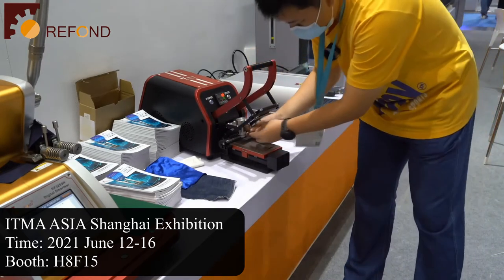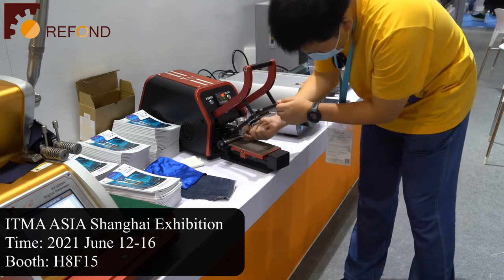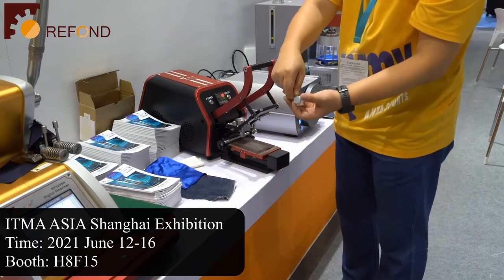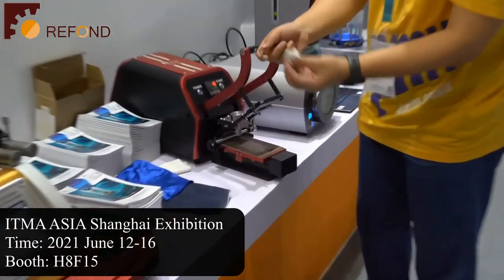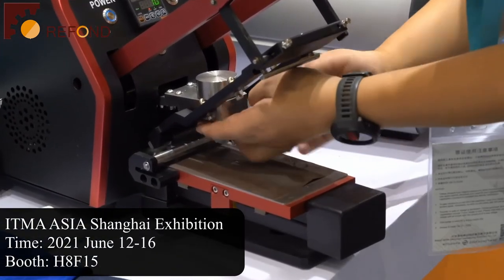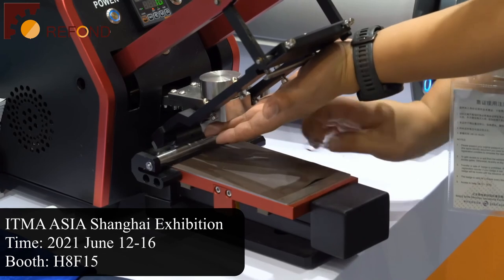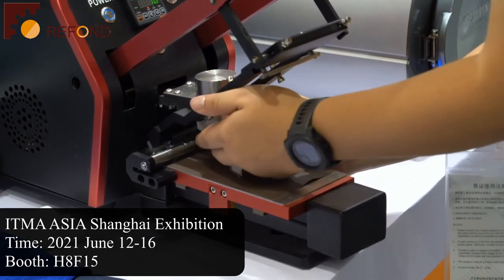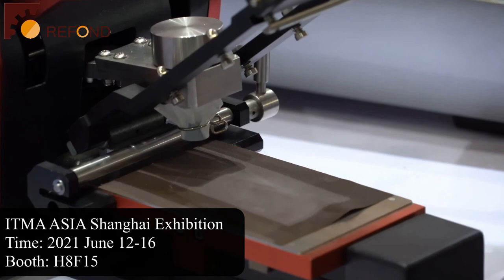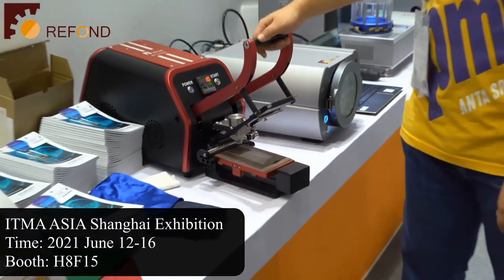For changing the white rubbing cloth, you just lift the handle up and then reach down to the spring. Squeeze it gently and the cloth will come out. Then you just need to put on the new cloth — put it on, hold it gently with your fingers, and then squeeze the little spring. Now you have a new cloth on the test head and you can start a new test. It's just a matter of seconds to change it — that's a wonderful thing.